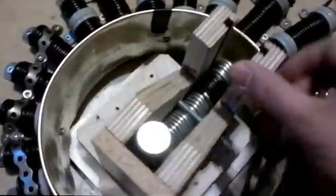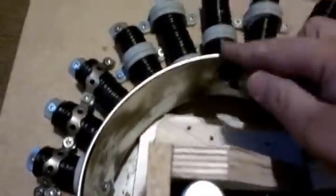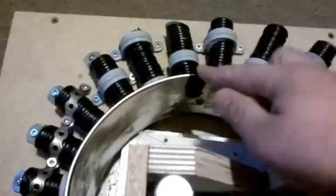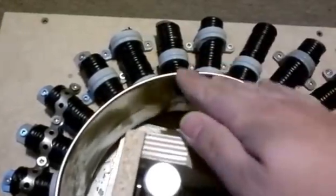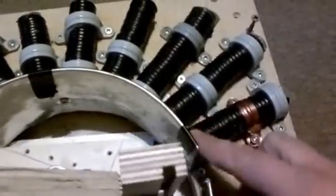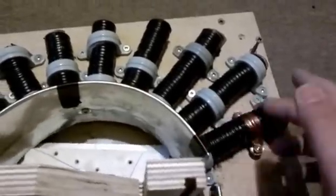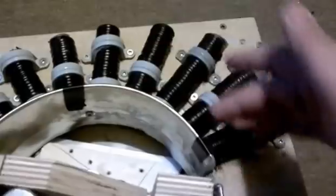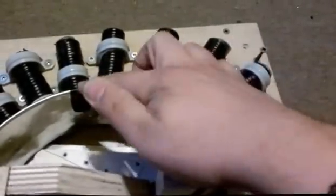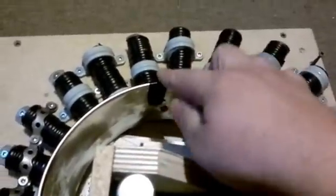I put a piece of tape right here. This magnet was my strongest magnet magnetically — my magnetic moment where everything is focused. So that's the strongest sticking point. And where this biggest magnet is, is the second sticking point I have here. It's not as bad as this one, but right now I've got two cogs — this cog and that cog. So I'm trying to narrow the gap down and get it to just this one cog.